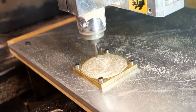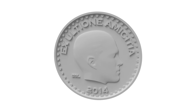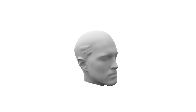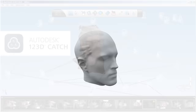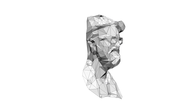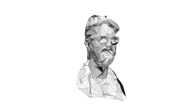There are two ways of making a realistic looking 3-dimensional head on a coin without modelling it from scratch, but unfortunately both are somewhat time intensive. The first one is perhaps the easiest — it requires you to acquire an actual 3D model of your head. There is software, even free software, from Autodesk called 123D Catch, which can take a series of photos and stitch together a decent 3D model. For an entire head you need to sit perfectly still while someone photographs your head from every conceivable angle — somewhere between 50 and 100 photos. However, if you're only doing the profile you could get away with less, limiting yourself to only one side of the head. There are plenty of good videos and tutorials on how to use 123D Catch, so I suggest you check them out.